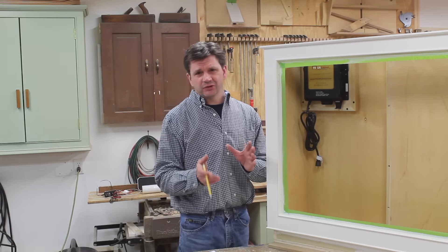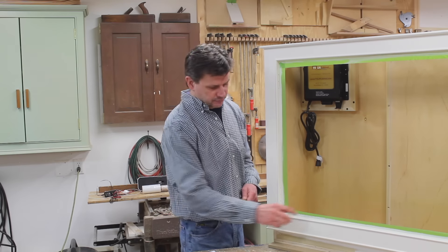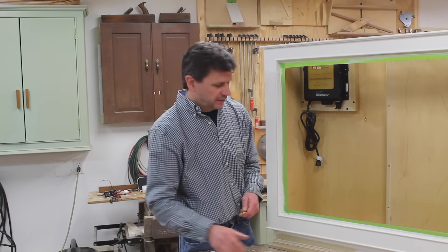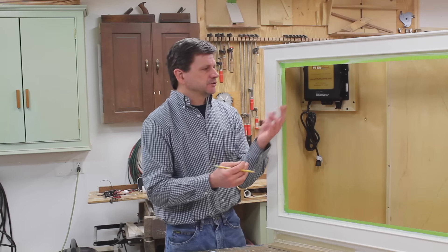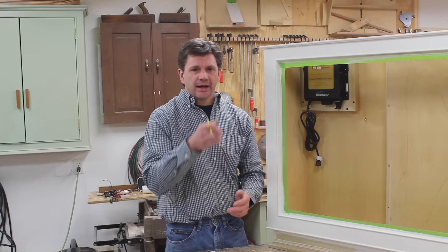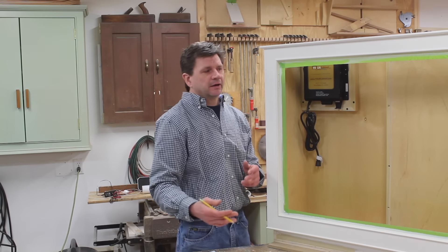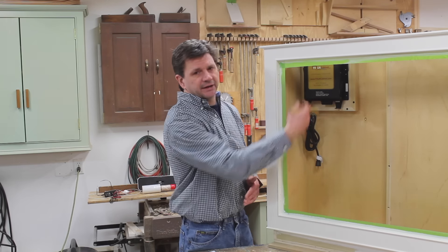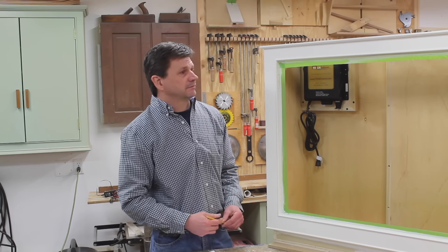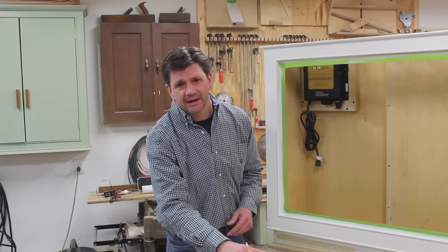When I'm hanging the doors — how do you position the doors? I use iron-on edge banding. I don't glue it; I just put two pieces for that thickness, about a sixteenth of an inch. I put that on the face frame, lean the door up, mark out where the hinge is, then hold the hinge up to the face frame and drill out with a self-centering bit — also known as a VIX bit, if you Google it. Once the holes are there, I connect the hinges to the doors first and then connect the door to the cabinet. I think that answers all the questions. Have a great day and I'll see you soon.